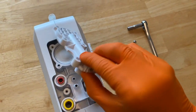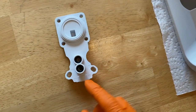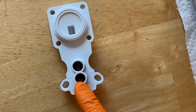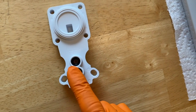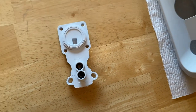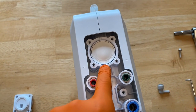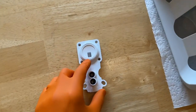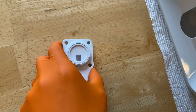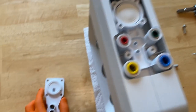We're going to pop this auto shutoff valve kit off and set it down here. You've got two circular cutouts and two rubber O-rings, one in each insert. The upper insert has what's called your check valve, which is a very important part. I want to direct your attention to the inner diaphragm of your auto shutoff valve kit — take note of that rectangle cutout.